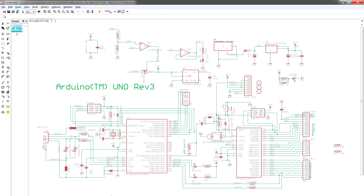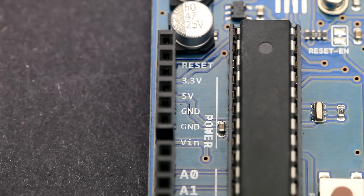If you have time, it's worth studying the Arduino Uno schematic. Don't worry if it looks complicated — you don't need to understand most of it. They took an off-the-shelf microcontroller that requires a lot of extra parts to get working, and they put all of those things together in an easy to use way. Over here you have the power pins. You can connect wires here to other circuitry with 5V or 3.3V. Just make sure that whatever you power doesn't draw more than a few milliamps — a few LEDs is ok, but a large motor would be an Arduino-no.